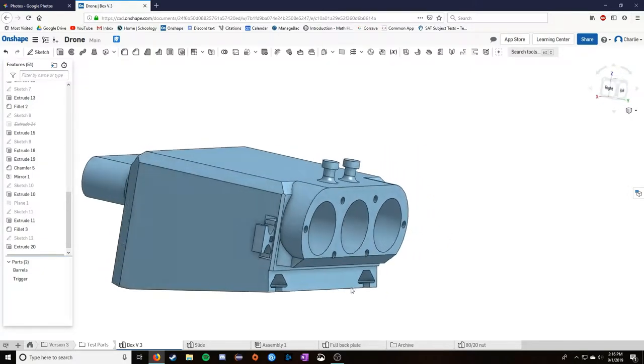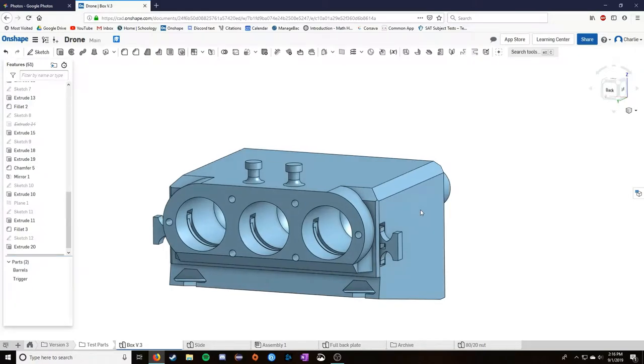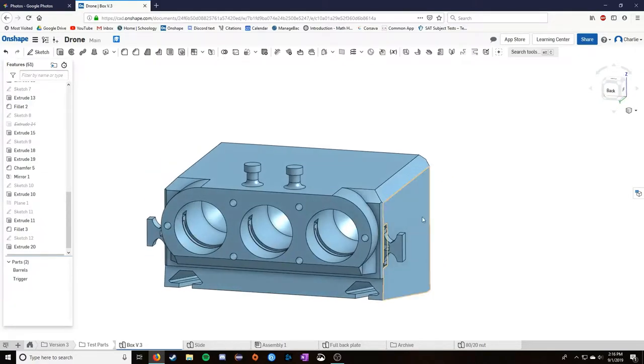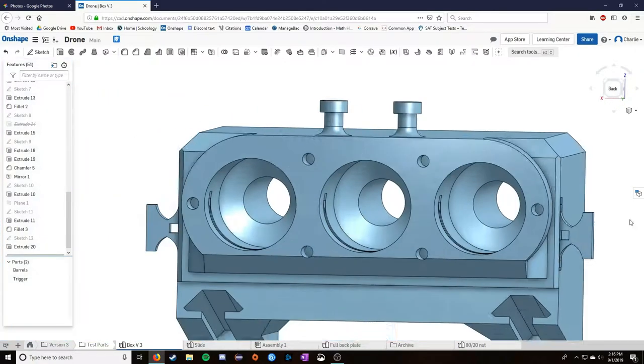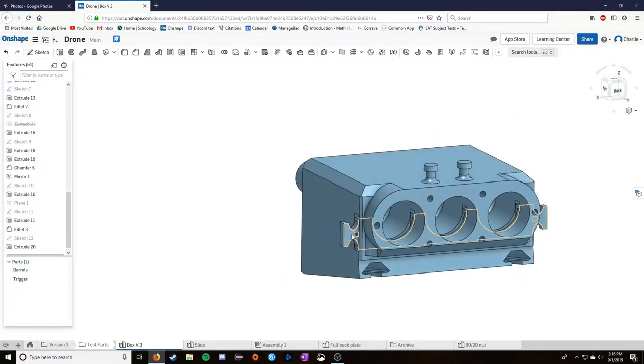So what I ended up doing was putting a servo motor here and a servo motor here, mounted them with VHB tape. That's basically just really strong double stick tape, if you're not aware. And I hooked a paperclip through here and through here, and then as the motor would rotate, it would pull the trigger up or down, and that would release the plunger after it had been pulled back. This trigger actually was attached with a rubber band up to these two, so it would be permanently pulled up.